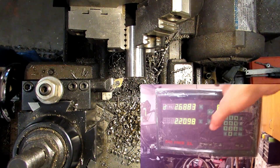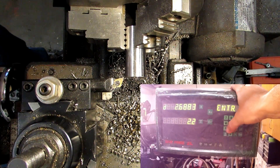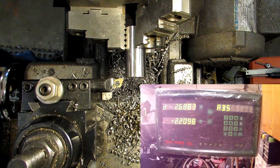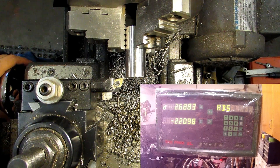We are at 2.210 and we're shooting for 2.125. I've gone ahead and input that dimension into my digital readout so I've got a visual reference for when I'm getting close to my desired size. You do have to pay attention on the digital readout to which way is positive and which way is negative, so you may have to type in a negative value to make sure you're going the correct way.